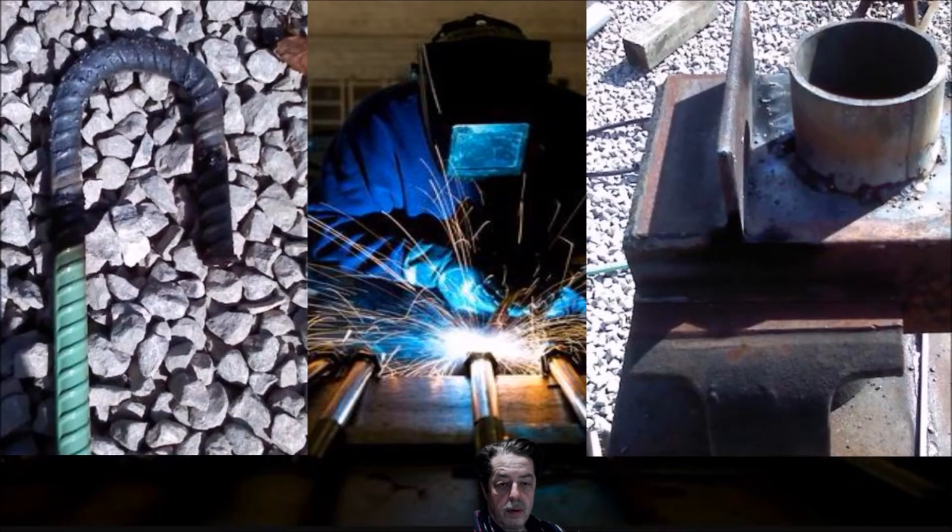Let's take a look up over here on the left — this is just a piece of rebar. You can buy it at any Home Depot, Lowe's, whatever. What he did: you can heat it up if you want to — it's going to create that bend much easier because it'll be soft from the heat. Or if you didn't have the heat, you can use a piece of pipe on the end of the rebar. Slide it over and it gives you a better lever so you can bend this real easy. The point is, this is the kind of bend you can put in it. By changing the diameter of that round piece of steel, you can change the diameter of the inside of that hook over here on the left.